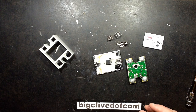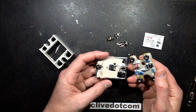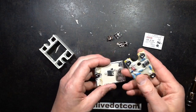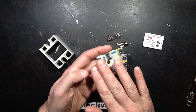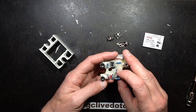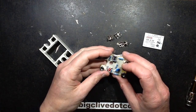That's it duly stripped to bits, and it came apart fairly easily, going to the fact that, as opposed to being full of resin, it just had a drizzle of resin over the components, and some had gone into the base. I thought it would have filled right up to virtually the point of these terminals, so everything was completely sealed for electrical isolation and protection against moisture and things like that, but obviously not in this case.